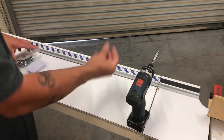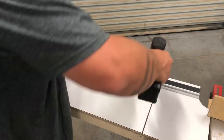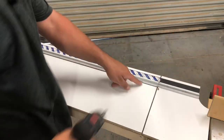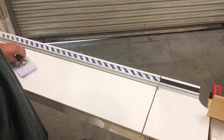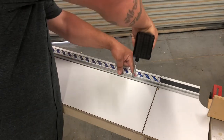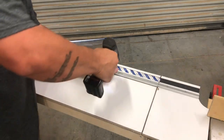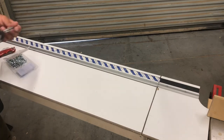Like I said, these screws are slightly bigger in diameter than the top opening of the T-track. But you'll see when you put them on — you just gotta worm them in there. They'll just barely nick that; it will not interfere with the T-bolt. I've been using this stuff for years and these just seem to hold the best. They're seven-sixteenths in length, so with the thickness of the laminate and the aluminum on the track, it doesn't poke out the bottom but it gets right there. Just work your way down.